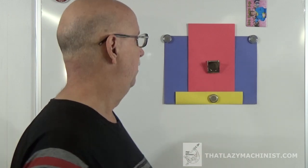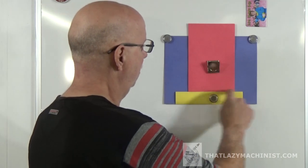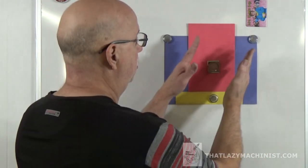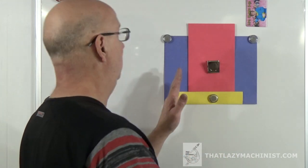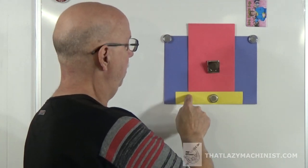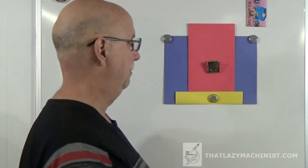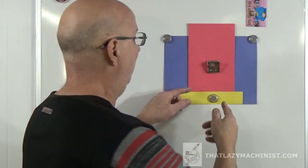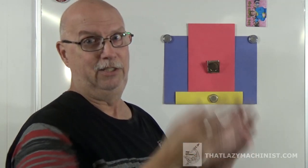If it's leaning towards the tool and I tighten the vise down, I don't tighten it final, but I do tighten it reasonably tight. It's going to be leaning this way with a full contact at the bottom. With my positioning hammer, I'm going to come and tap this to just bring it perpendicular to my table with the dial indicator. And when I do that, I'll be compressing this corner onto the parallel. So it's going to remain in contact. And then I tighten down solid, and if this wants to rotate, well, it will have to compress here and pull up there. And as I just mentioned a few minutes ago, that's a better situation. So let's head over to the machine and set that up.